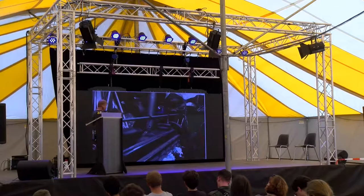And the alignment as well is something to take into consideration a lot, because I don't have a jig. I think for the next bike I build, we'll have a jig that will hold the front wheel and the rear wheel absolutely in position, then you build everything around it. Whereas what I did with this is I put guidelines and straight lines and spirit levels, just to make sure they're in alignment.